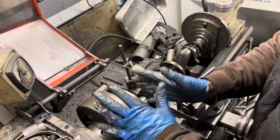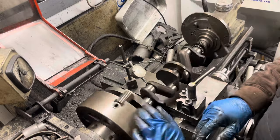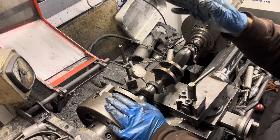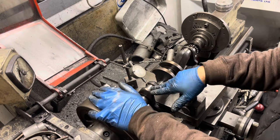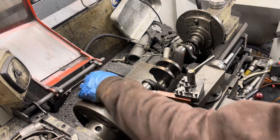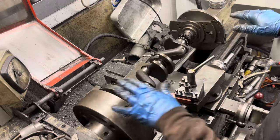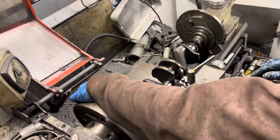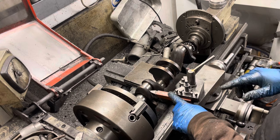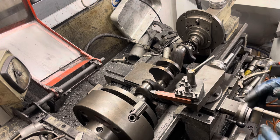I've clocked this up now on the front pin by just shifting the jaws. I'm purely thinking we want to machine number four big end pin, so I'll get that true and machine it. This end does run out ever so slightly — about 3 thou in one axis — so I'll concentrate on this one first while it's all nice and true, then move to the other end. We're finally ready to machine. Always do a manual lap to make sure nothing catches. You can see the whole point of this operation: the big end pin is true, everything else is out of balance so it's going to have a right old shake on. I'm going to go really slow — about 85 revolutions. No idea what the finish is going to be like, but I'll get stuck in and make adjustments as we go.